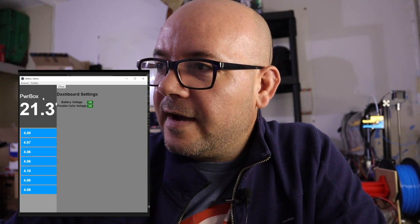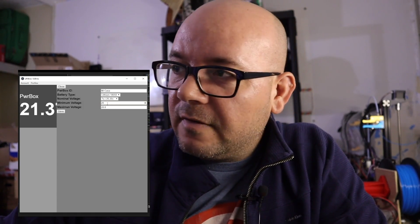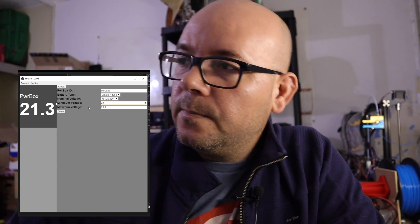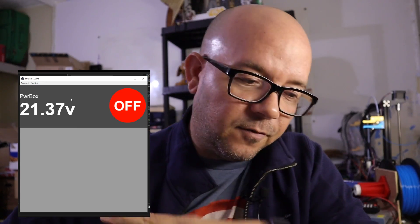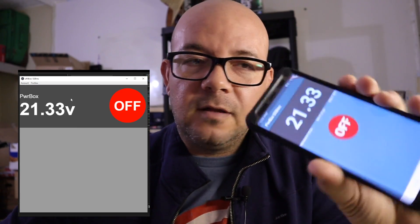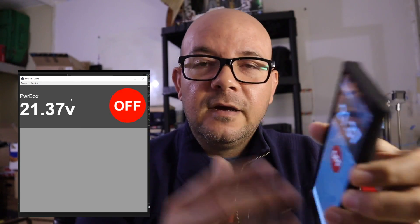Let me just turn this off really fast. Right now, my battery is set to cut down the voltage at 20 volts. I'm going to change that to 22 and hit save. Right now, since we are at 21.37, it's going to be under voltage. So if I try to turn on the battery right here, it's not going to allow me — I need to change this. It's not fully coded yet, but it's not going to allow it.